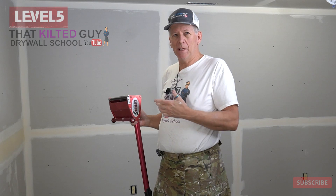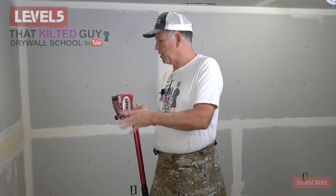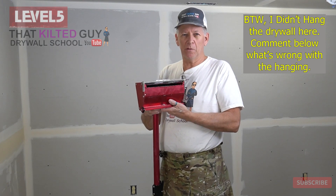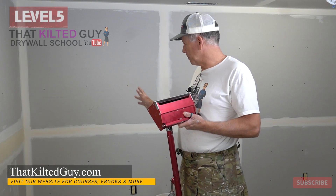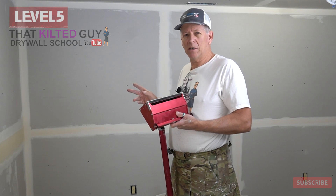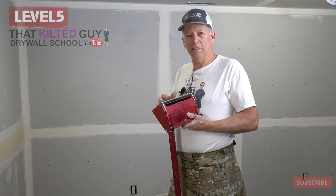We're taping and finishing a new job here and I'm ready to start coating the joints. I coated this one by hand — I did that for a separate video — but I'm going to show you the pro version of coating new construction joints on the wall. This is the level 5 10-inch mud box. Generally when we do our first coat, we want to do a 10-inch box on the joints, then on the second coat we move up to a 12-inch, which I'll show you in a separate video.